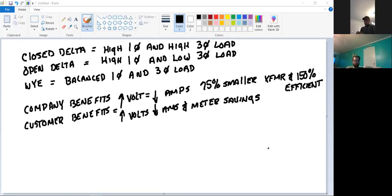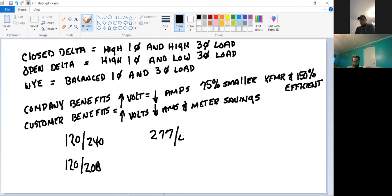So Professor V threw a, I won't say abnormal, it's normal to us, a different voltage out there. If you remember what it was, normally our home runs off of what? 120-240. We talked a little bit about restaurants and whatnot. That's 120-208. But he also gave one that was what, 277 and 480, correct? Yes, sir. All right. I will let you know the transformer that feeds building 300 or any of the buildings out there at the college, the secondary output is 277-480. That's going into each one of the buildings out there at Horry Georgetown Tech.